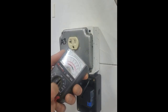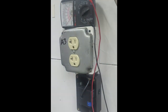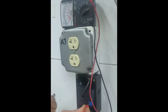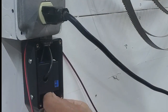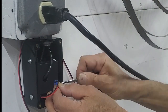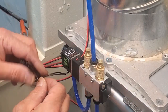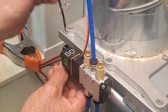I've set my multimeter to check for continuity across the K terminals on the current sensing switch, to confirm it's functioning as planned. The switch has red and green LED indicators on its top that are telling me the same thing. Next I need to connect some low-voltage wire and run it over to the blast gate, and also run my 12-volt power to the gate.